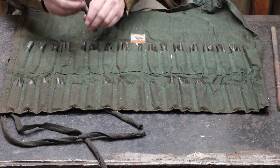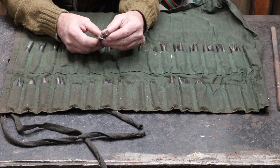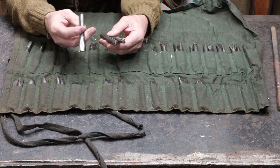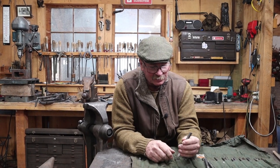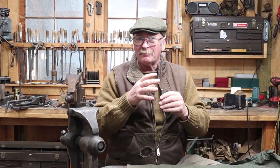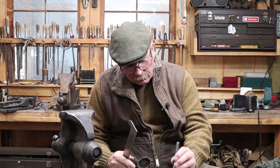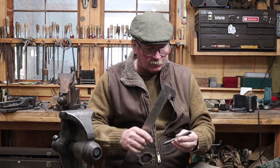There are all sorts of things in here: teardrop shaped tools, chisels, little swedges, butcher tools, and lots of stuff. But these are relatively short, and if you're trying to work by hand at the anvil, I think these are a little bit too short. You can use them for lighter stuff that doesn't radiate a lot of heat, but if you're working on a bigger piece of hot material, I like bigger, heavier tools. You can hold these in a pair of tongs and they work pretty well, but I think you get more control when you can just really get in there and control them by rolling your fingers a little bit.